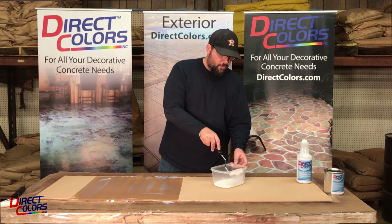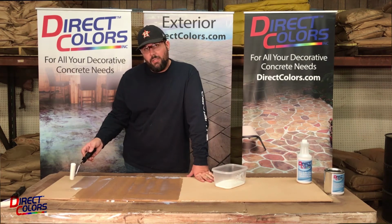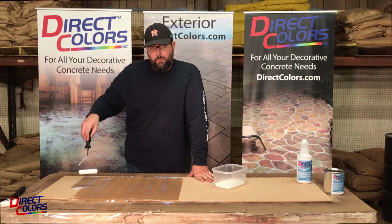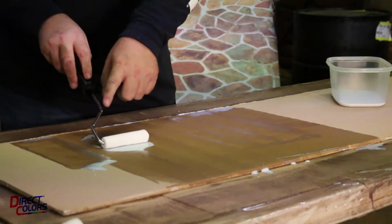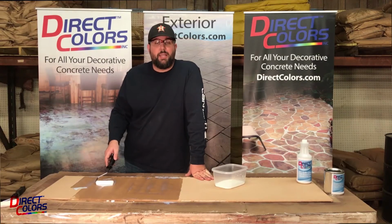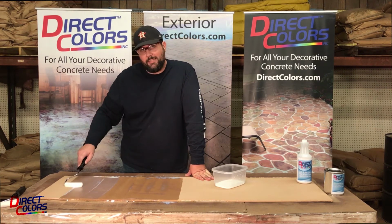Whenever you're rolling out, it's kind of like painting a wall. Whenever you're rolling, if it starts to get a little thin, you don't have as much material in your roller, don't bear down on your roller and force material out. Just go ahead and wet your roller again, because when you bear down on it, material is going to start spilling out to the edges, and you're going to get a heavier application out towards the sides of your roller. That can lead to roller lines. Let the weight of the roller do the job, and then come back and wet it as necessary.